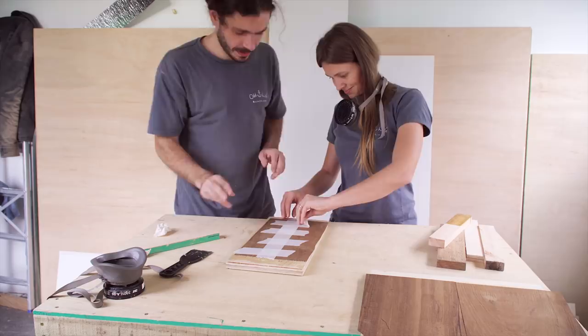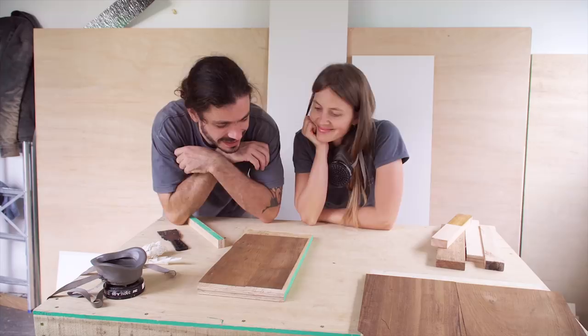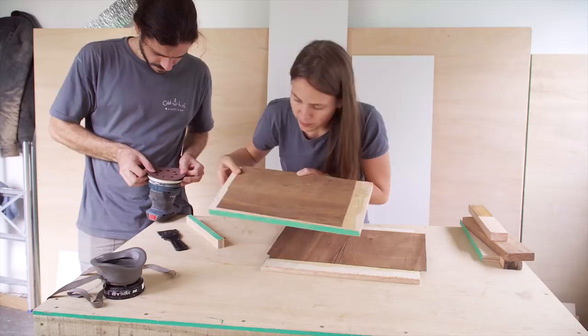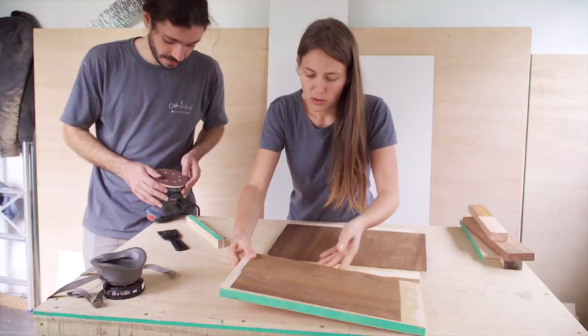That's really, really good. It's amazing — so cool, so beautiful. The cool thing is that it's 100% wood — not laminate, not plastic, that's wood. And we have many more color options to choose from. By the way, the crack that we put tape over before gluing — you can barely see it now. The veneer is easy to crack, so we need to fix cracks instead of throwing pieces away. The tip is to put tape on every single crack before you glue.